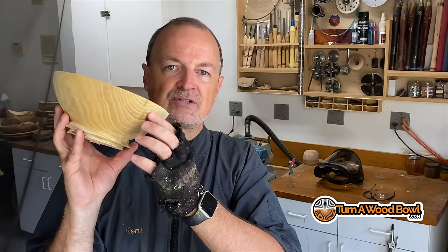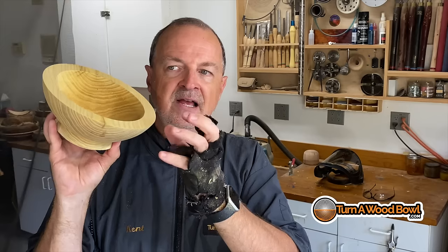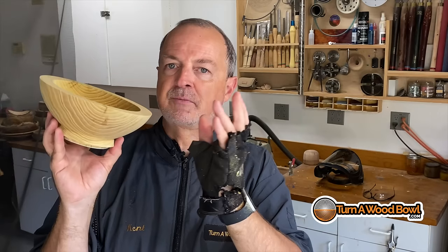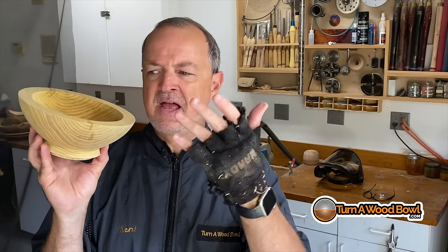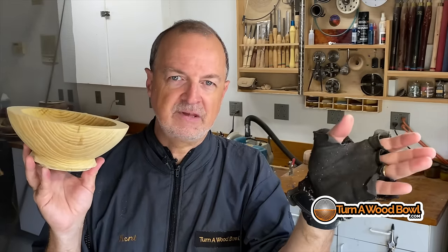So why would we want a microwave? There are a lot of options for drying this. I could just stick it on a shelf and hope for the best, but there's a chance of cracking on the end grain because the end grain will let moisture out faster than the side grain. You're going to have uneven drying, and that can be a problem. To help that, you can put anchor seal on just the end grain and then stick it on a shelf. You could also put it in a dryer — a simple box with a light bulb creating heat — but that's still going to take a month, maybe two months, depending on temperature and humidity.